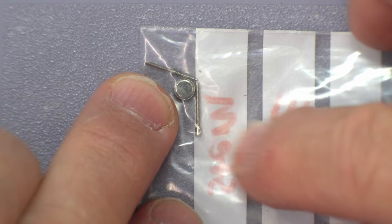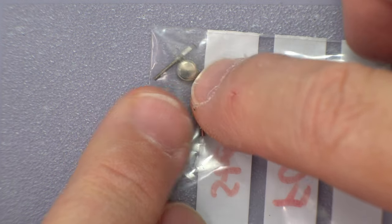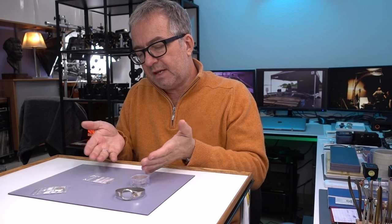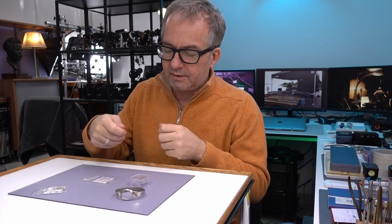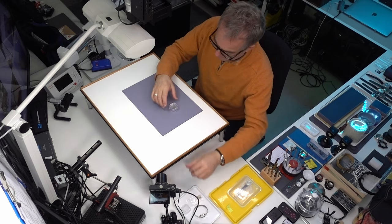And this is just to give you an idea, this is a stem and an extension from the Fope watch. I'm not sure what crown that is. I think I was just messing around with that. But here you can see the stem. And now I'm going to take it over to the bench and just show you how I have two options to make the stem. One is to make it out of raw stock, and the other is potentially to find a similar stem that's bigger and then turn it down, which would require a little bit less material removal.